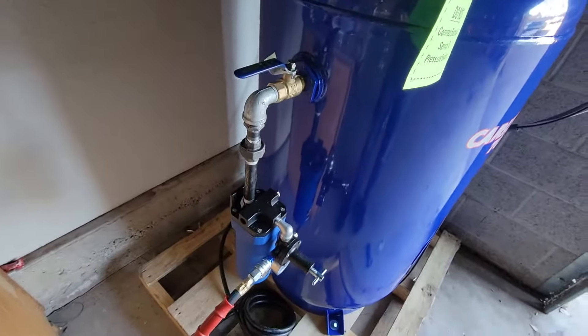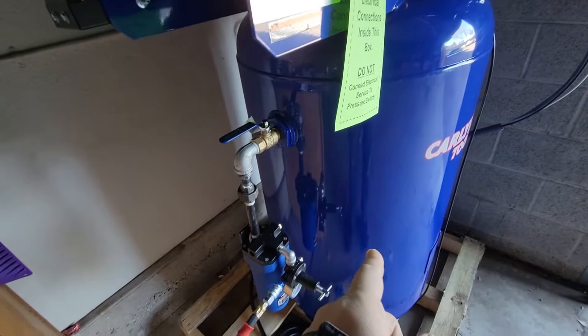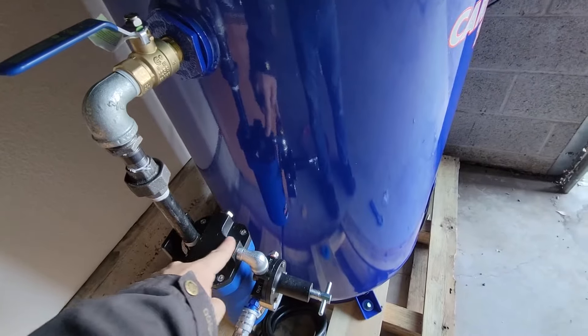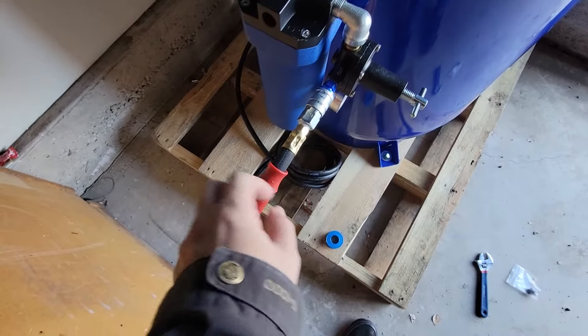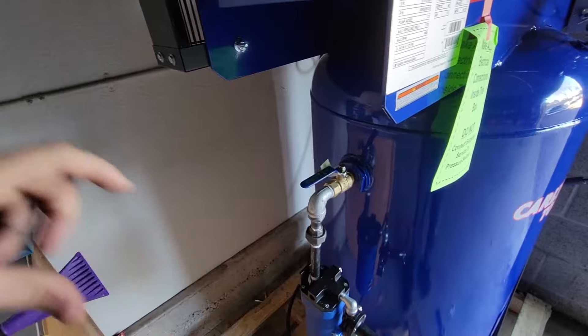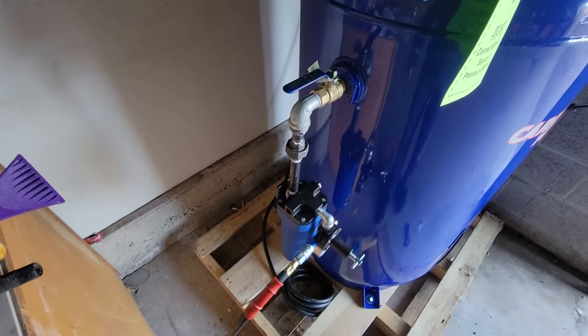One other major mistake: reducing from 3/4-inch fittings down to 1/2-inch down to 1/4-inch severely limits your CFM. After I get the compressors hooked together, I'm going to run one single 1/2-inch line all the way into the dry ice blaster and I should be good. Worth it to start a business — there's none of this in Albuquerque. As a hobbyist, absolutely not unless you know somebody with shop air you can borrow — then it would be 100% worth it to buy this machine.